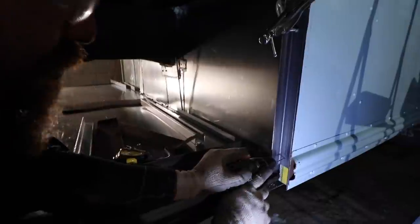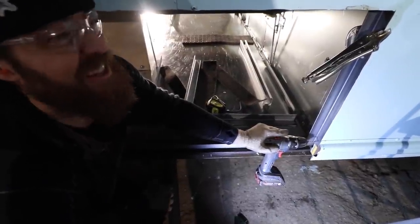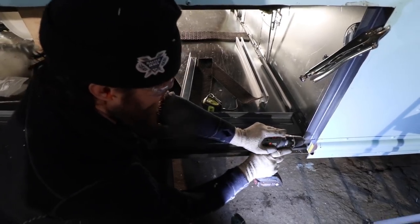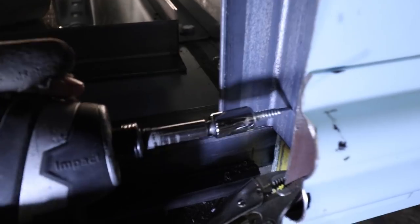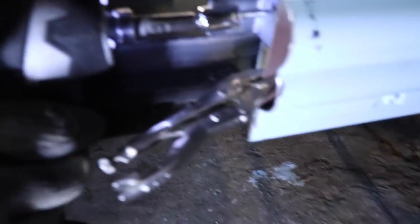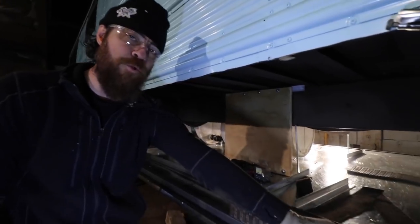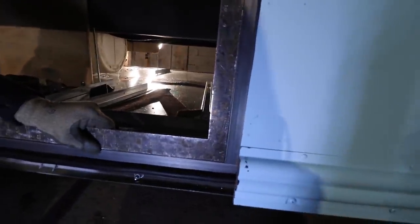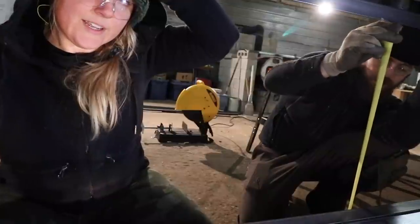This one's going to be a little different because we're going to use self-tappers here, but we're going to pre-drill the hole because historically self-tappers work best with a pre-drilled hole — less work on their little self-tapping noses. These guys are called hex head self-tapping screws. Now we'll check it for squareness. Oh yeah, that is pretty dead-nut square — that is pretty effing square.